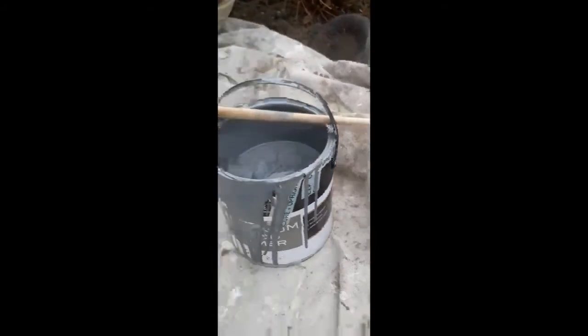At this stage, we're structurally done, and if you get a little bit closer you'll see some little nuggets along there. But there's rain due, so what I want to do is get this sealed up. I'm going to put an aluminium based primer on it, and then after that, those small little adjustments are just part of the normal painting repair ongoing cycle. So here's just an aluminium based primer on it, so that'll soak in.